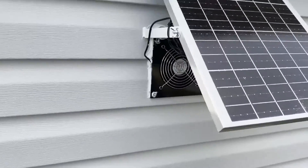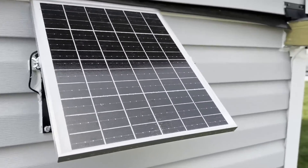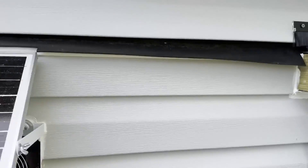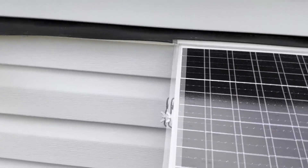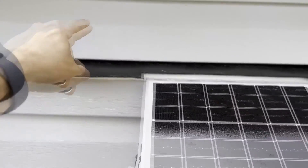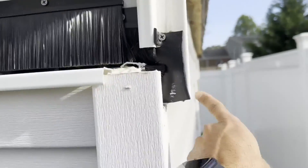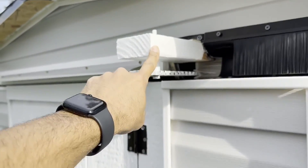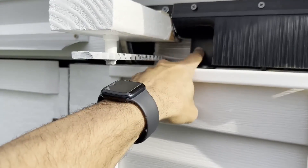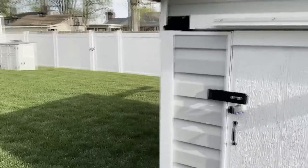I still have solar fans — these are 180mm solar fans from Amazon, comes with a 25-watt solar panel, and they move a lot of air. For weatherproofing, I used brush seals around all the openings and around the top. This weather stripping is from my old observatory, placed where the roof separates from the shed. I also added a drip edge over here so water won't blow in.